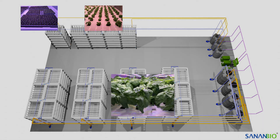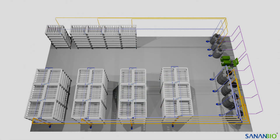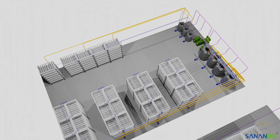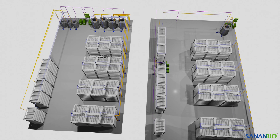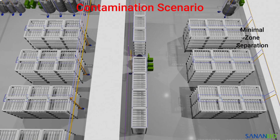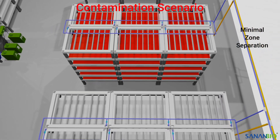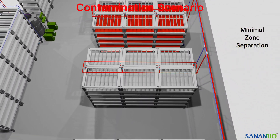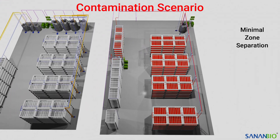At the very least, design should separate propagation from vegetative growth phases. Separating plumbing zones helps control widespread contamination. Contamination includes both human and plant pathogens which can cause major disruption to an operation. A common example is pythium, a waterborne plant pathogen that can severely stunt plant growth. It's best managed by shutting down a system completely, sanitizing it, and starting up again. So if all the modules in your farm share the same network of plumbing, they all have to be drained and sanitized before proceeding with your operation, meaning a loss of time and resources.